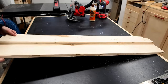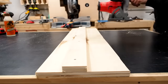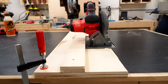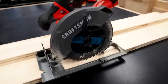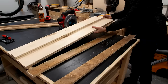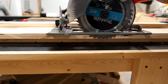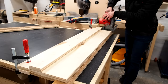All that's left now is to cut the edge to make the zero clearance edge, which will really help you get clean and precise cuts. The jig is pretty simple — the key is to leave enough room on the opposite side of the base so you can clamp down the track without getting in the way of the motor. There's a little excess material on the blade side that I'll trim away for a perfect zero clearance base. To avoid tear out, set the jig on some scrap wood for this, then set the height of the blade so the tip of the teeth are just poking down underneath. Then make the cut making sure the base plate is pressed up against the fence throughout the entire cut.